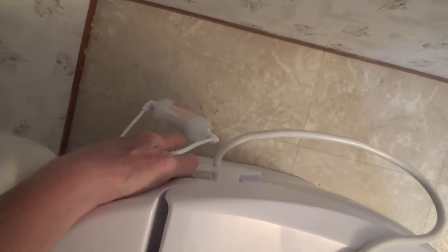It's a little hard to get in here for two people, a little hard to see. But just to give you an idea, there is a 90-degree angle fitting that comes off of the base of the toilet seat and the bidet itself. It goes down to another 90-degree angle to the water filter, and then another 90-degree angle on the other end of the filter. Those are all part of the little pack that you saw with all the hardware initially. And then the other piece, of course, is going to be what feeds the water in — but that keeps the sediment and stuff that builds up in the tank from getting into the bidet. There's a very small spray nozzle, so you don't want to clog that — you're going to have to use the water filter to keep that cleaned out. It comes with all the fittings to do all that. That just runs over to the actual floor, to the valve down there, and locks into that three-way valve.